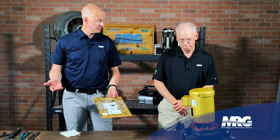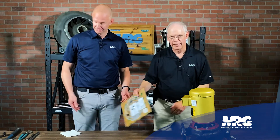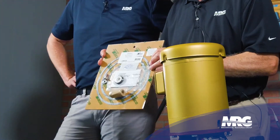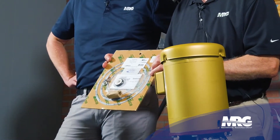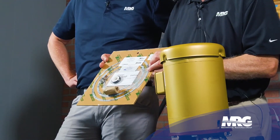You've got the pump seal kit. If you're going to change the pump seal, you have a pump seal kit — it comes with the seal, both the stationary seal and the rotating seal. You've got your gaskets for the casing. And in this kit, you get a new impeller cap screw and washer.